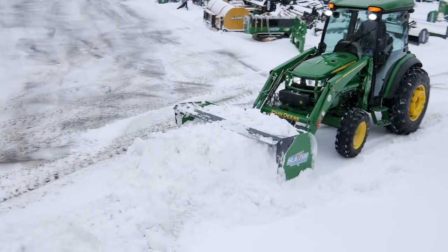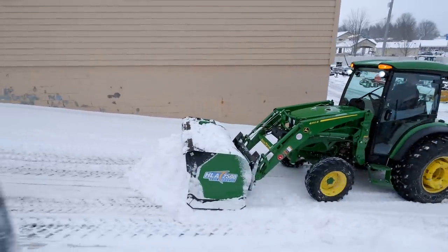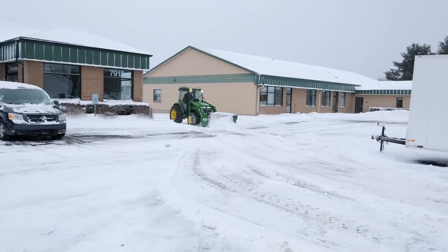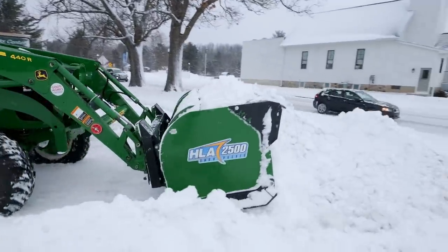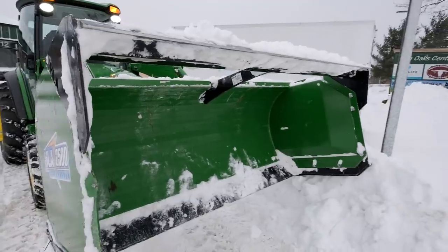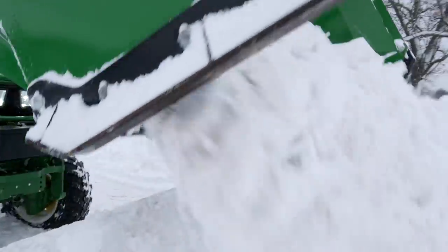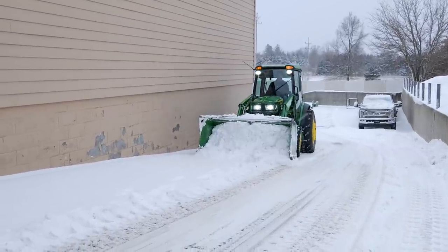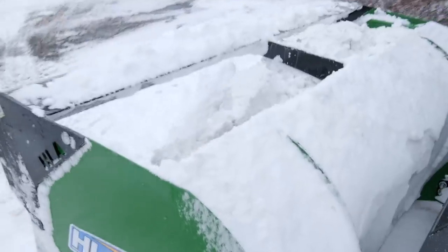For me, I like simple. When it's freezing cold outside and something goes wrong - because things always go wrong - you want to minimize those chances. Without any moving parts, all you have are replaceable skid runners and edges; there's nothing to really break. A box is going to handle whatever you throw at it - a couple of inches of snow for cleanup, a foot of snow, wet heavy snow, light fluffy snow - it doesn't really care. The downside with plows and pushers in general is that you do have to have a place to put the snow. You can drive these up on piles and stack them, but at some point you could potentially run out of room.